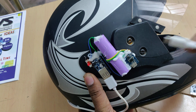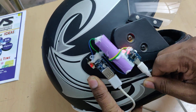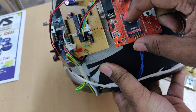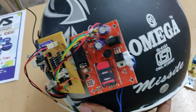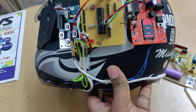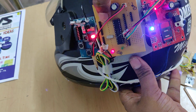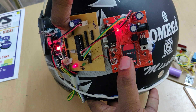When charging, this light will blink initially. Once the battery is fully charged it stops blinking and stays continuously on — that is the indication of a full charge. The main on/off switch is here. Insert a valid SIM card into the GSM modem — push to open and insert the SIM card with adapter. It is better to use Airtel or Vi rather than Jio, because Jio is LTE and LTE modems are not available for project purposes. After switching on the kit, hold until the microcontroller gets signal — the light blinks fast at about one second intervals; once the GSM modem gets signal, it slows down.